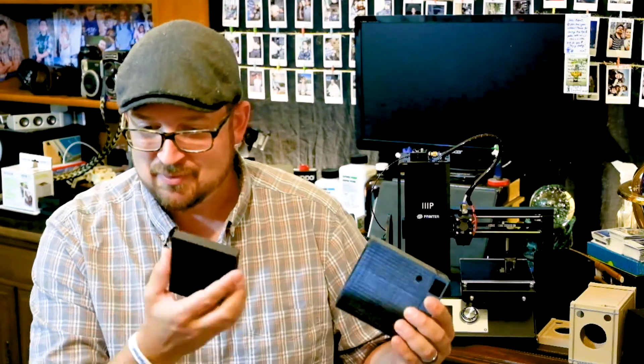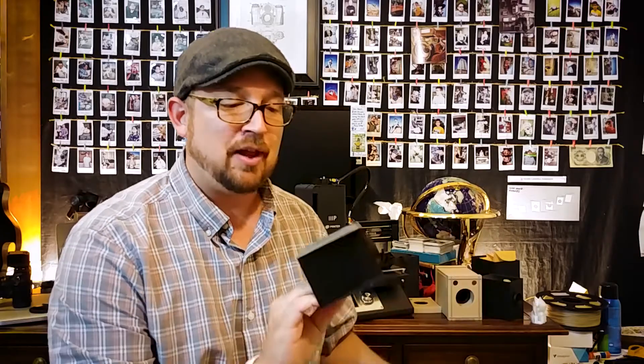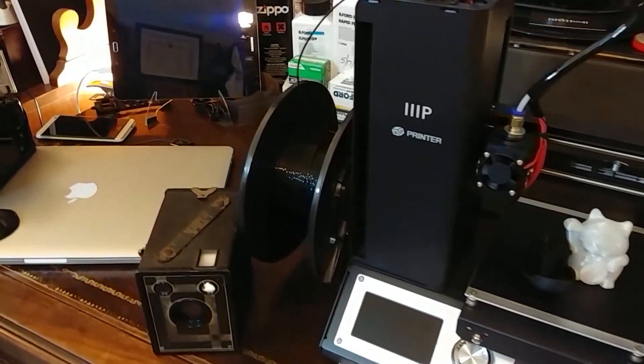The first thing I've been doing with this printer is creating a camera. This was the actual first prototype — I did this entire prototype in SketchUp. We're looking at the prototype without lenses. This is a modular box camera, so I had to create a couple of important pieces: a cartridge — a module that would accept film — the actual box, and the internal design for where the different reflective elements will go. And I had to make sure that it would all fit quite well.